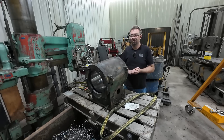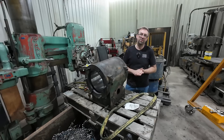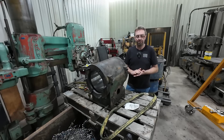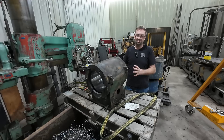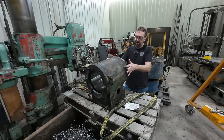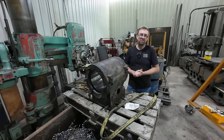Some of the questions people were asking about the piston — shouldn't you have the piston before you bore the cylinder? Well, no, because I'm making a new piston. The new piston is going to be aluminum, so when I make it I need to calculate out the thermal expansion of the cylinder and the thermal expansion of the piston, and then size everything accordingly. I need to know what the cast iron will do and what the aluminum will do — I'm looking at a couple of different grades of aluminum.